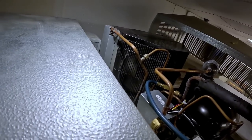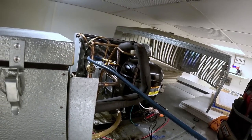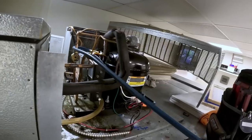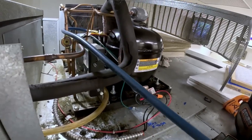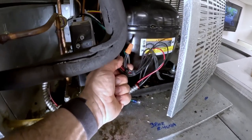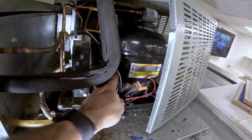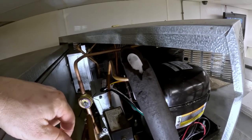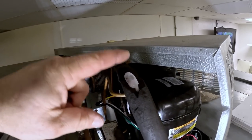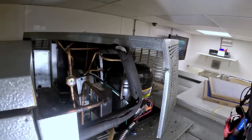There you go. All right, so we did add a little bit of refrigerant to it. Got our sight glass full there. 4 ounces put me back to clear, added a couple of extra ounces. Gotta grab a wire tie too, get this cleaned up and then we'll wrap it up. Got that all wire tied up. It's all locked in together there, so nothing's gonna come apart. Nothing's rubbing anything or anything tight. Put a frost in it. It's really hot up here, but I checked the superheat last time and it was fine. I didn't have any problems with it at all.